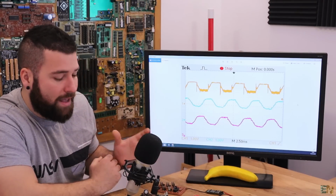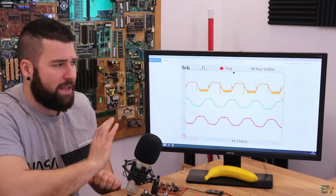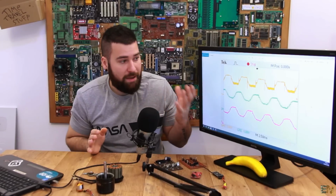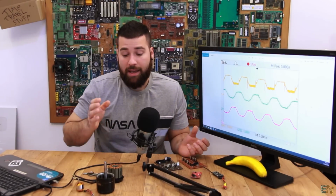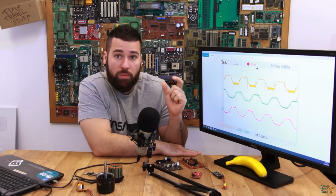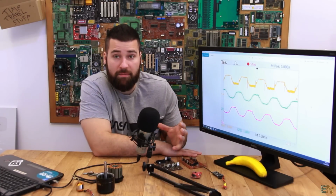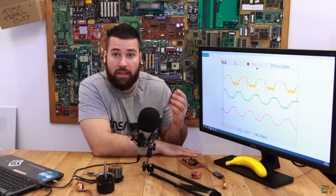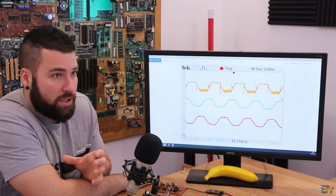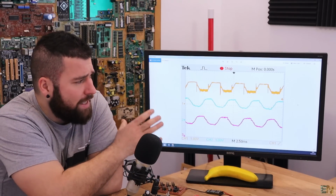ramp. If we look at the voltages at a normal brush motor, we will see that the mathematics, if we make the integral of these waves here, we will have the same result. So the mathematics behind the brush DC motors and the brushless DC motor are the same. These are just very small pulses of DC voltage. Also, we are using a DC battery to supply this. We apply that to an electronic speed controller that will apply small amounts of DC pulses to the motor. So that's why we consider this a DC motor and not an AC motor, because this is not really AC.